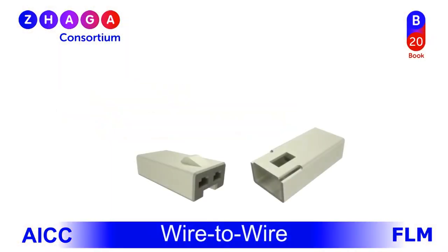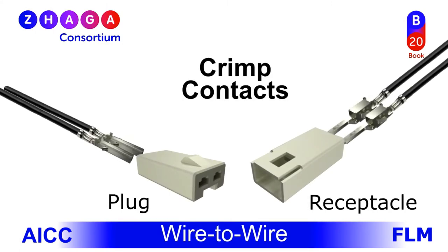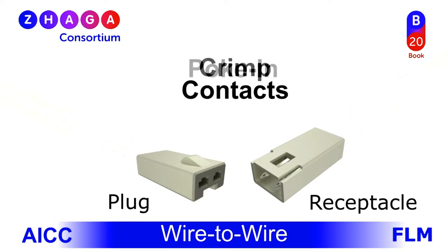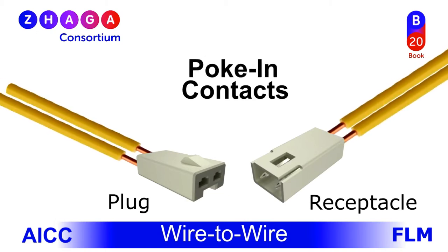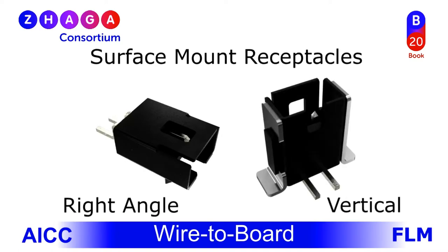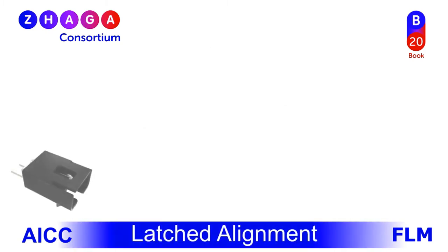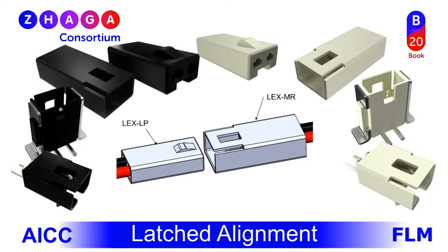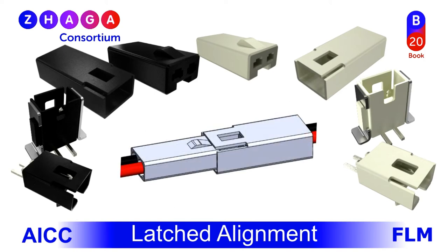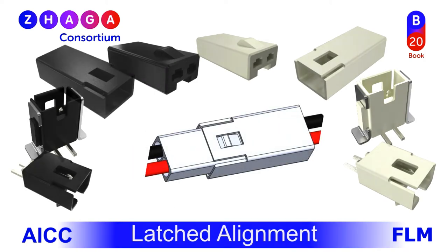The wire-terminated plugs and receptacles feature a pin-socket contact interface available with separate crimp contacts or with pre-installed contacts and poke-in wire termination capability. SMT receptacles in right angle or vertical configuration are also available for integration into the body of the sensor. The plastic housings, available in black or white color, feature a dimple latch to prevent any accidental unmating due to vibration or shock and provide polarized mating alignment for error-free connections.